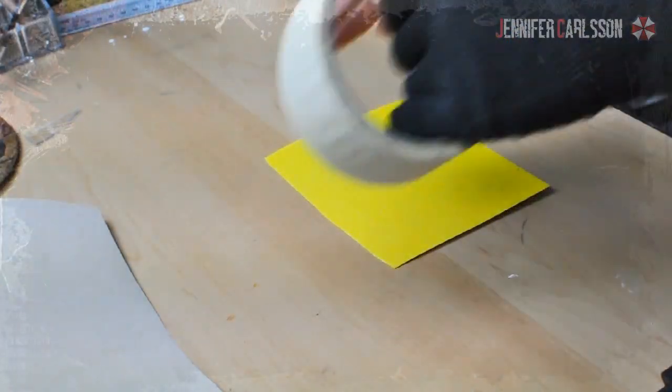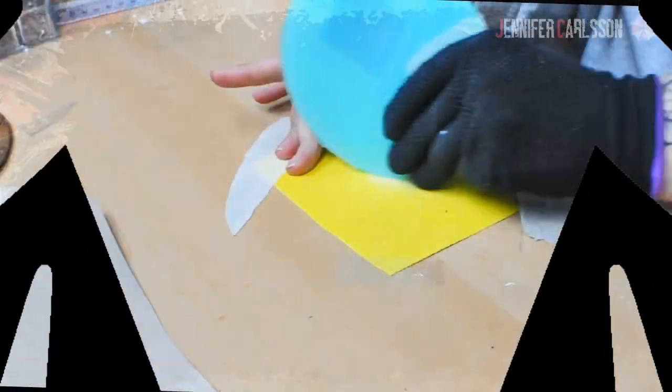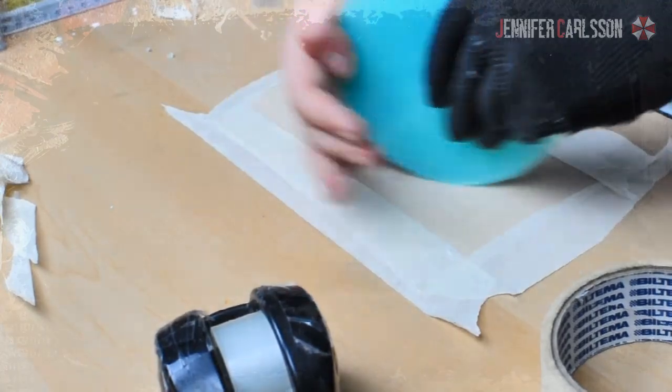So to smoothen the edges of the acrylic pieces, I'm going to tape down some 80 grit sandpaper and then later some 180 grit sandpaper. And I also taped the 3 pieces of acrylic together so I know that they are sanded down flush to each other so they are not uneven when it comes to the measurements.